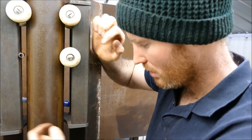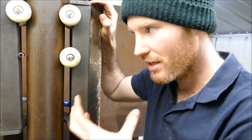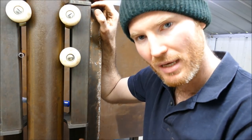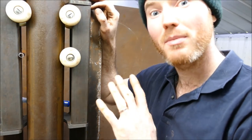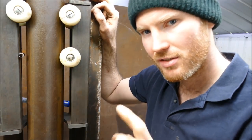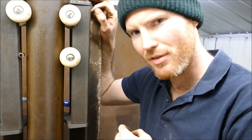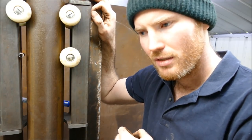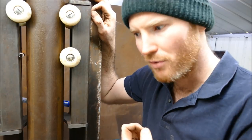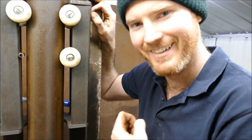And then what I'm going to do is essentially get everything lined up, get these pieces clamped on under tension, and then I'm going to weld the pillars on. And everything should be set in place where it's meant to be, and that will be it. It won't be coming loose because it's welded together. Now, funnily enough, some of you guys who have already attempted to build your hammers have done the same thing. So in my head, it was like, if it ain't broke, don't fix it. But now it broke, I've got to fix it, and I've copied what you guys have done.